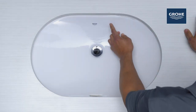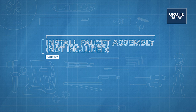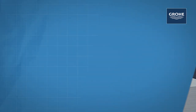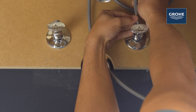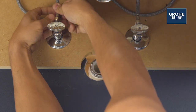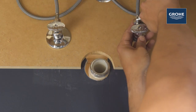Once your new Grohe is in its proper place, simply tighten the screws to secure the bowl to the countertop. And, of course, remove any excess sealant from inside the lip. Mount your faucet on the sink following the manufacturer's instructions. Connect your supply line to the faucet, just finger tight, and carefully bend the tubes to engage the supply shutoff valves.